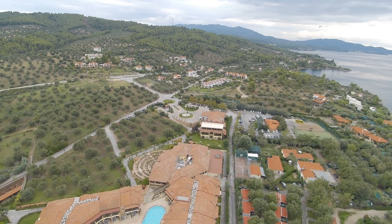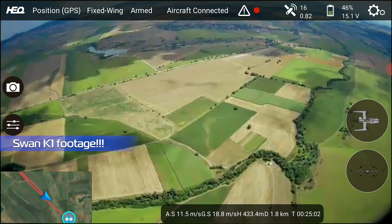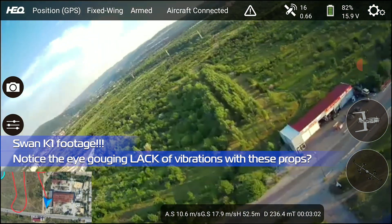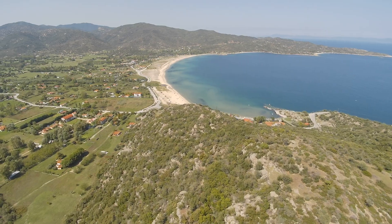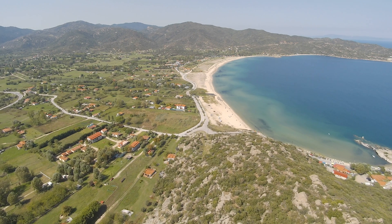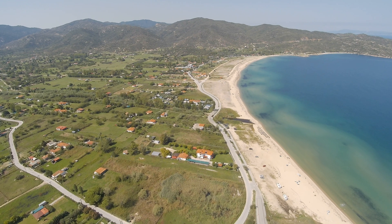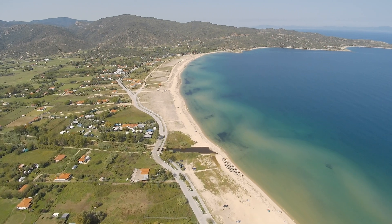The Voyager may have the benefit of a damped gimbal, but the K1 would strongly disagree with HEQ's statement that these props are OK. The only flight that was OK with the K1 and did not show any vibrations was the one where I used the original DJI Phantom 3 props, which are as close to balanced as you can get from a factory prop. Given that almost all of the people that founded HEQ are ex-DJI employees, I'd expect they would be aware of the importance of balanced props. And them being ex-DJI employees actually explains why this plane looks like something DJI would have designed if they ever made a plane.